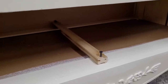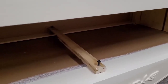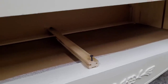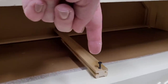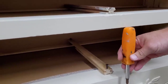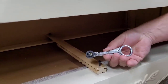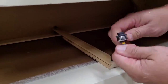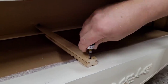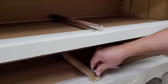I had a drawer glide that needed a little repair. All I did was take the existing drawer glide and flip it, because the other side is perfectly good. Even if your drawer glide looks worn on one side, don't think you can't just flip it. The next thing was getting a screwdriver in there — which is nearly impossible in tight spaces. So I'm using this cool little tool made by Klein Tools — a little ratcheting screwdriver where you put a regular drill bit on that magnets in, and you can just ratchet the screw right back in and reattach the drawer glide even in the tiniest space.